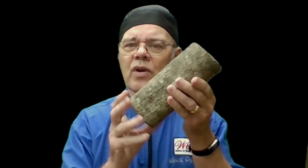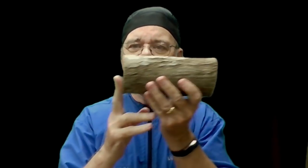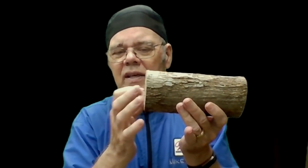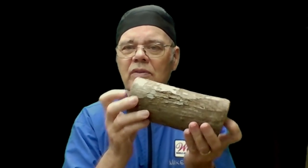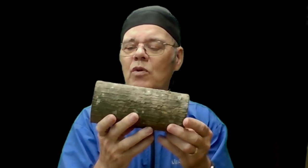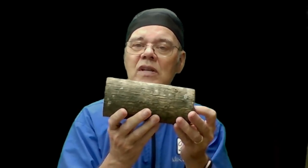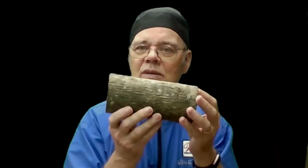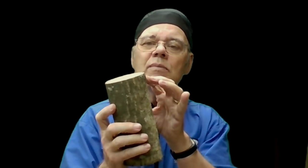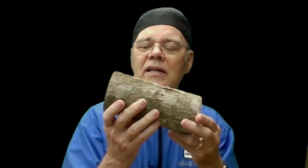They do require a piece of green wood. Branch wood is absolutely the best because the pith is more likely to be off-center — as the branch grows out the side of the tree it develops reaction wood and grows differently. You don't want the pith going through the middle of the stem. Dry wood you're not going to have good luck with. Green wood is easier and more fun to turn, the shavings fly off, you don't need to sharpen your tools as often. Green wood is also a little more elastic, so it's less likely to snap, and you're more likely to retain the bark.